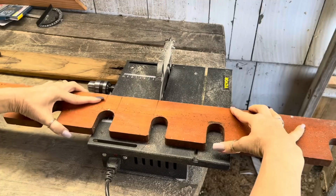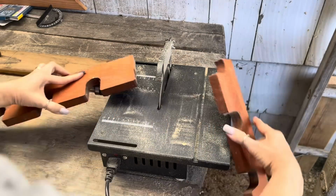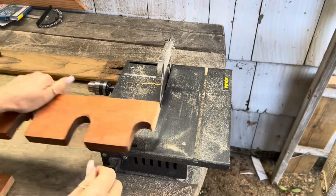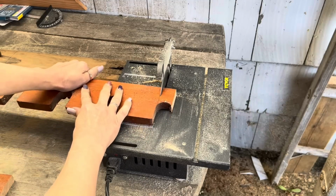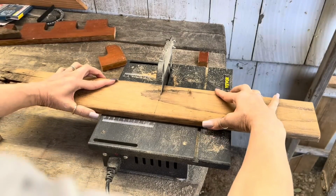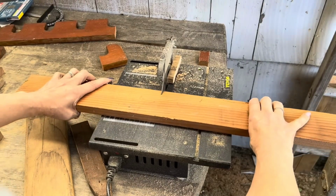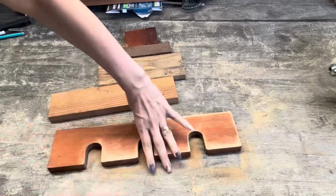And we're going to, of course, make it into a tree shape. You can see my boards are already marked, so I'm cutting the little spot for the very tip top of the tree where the star is going to go. I started out with this board, which is my bottom board, 14.5 inches long. And then each board above that, I shortened by 3 inches. So this one was 14.5 inches long. My next board, which is this one here, will be 11.5 inches long. Then my next board will be 8.5 inches long, which is this one. And the one I cut before that was 5.5 inches long. And of course, our little square piece at the top.